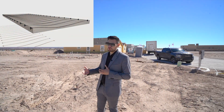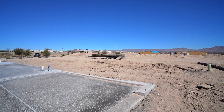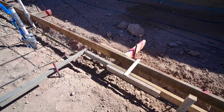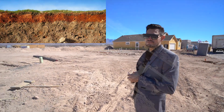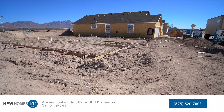The other type of foundation is the post-tension slab. That one's a little more complicated and requires more work and time. You'll see it here and there, but not so much here because our soil is a lot harder than in other areas. You're going to see it more where there's clay and more movement in the soil. Although all builders have their own practices, I still prefer steel for that extra support.